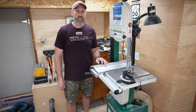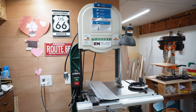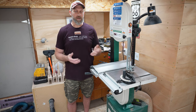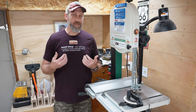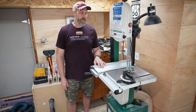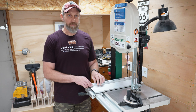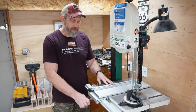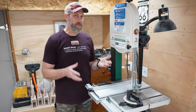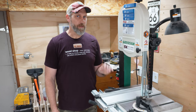Moving on to more woodworky things — this is my 14-inch resaw bandsaw from Grizzly. This was a gift from my wife. All the tools I have were either purchased with my own money or a gift from my family — Christmas, Father's Day, or something like that. I don't have any sponsors, so none of these tools were given to me by tool companies. The saw has a 12-inch resaw capacity. One thing I really don't like about it is the fence. When I get it set and lock it in, it changes, and I cannot get this fence rail system to work well. So I may be upgrading that at some point.